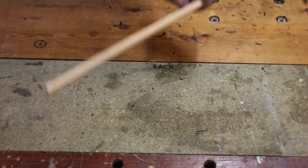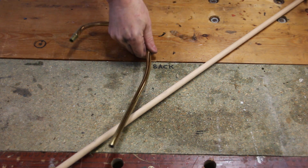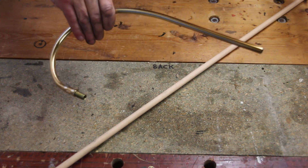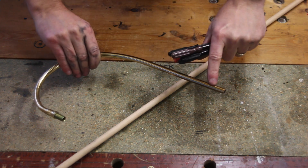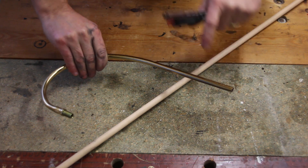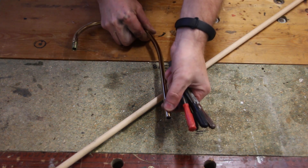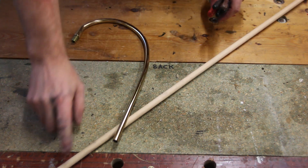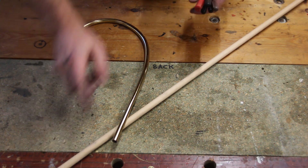For this build, all I'm going to need is some hardwood dowel and some tubing. This is off an old light fitting — and pretty typical for me, I didn't throw it away. It looks like it's brass but it's not; it's just steel with a brass-coloured coating on it. I'm only going to want small pieces of this, and these are going to make the collars of the handles, which prevents the wooden handles from splitting when I put the files into them.